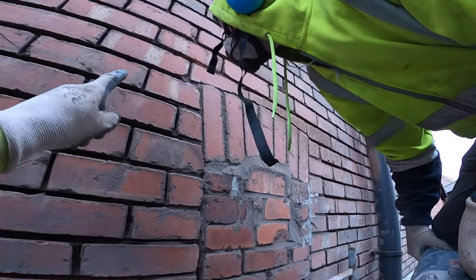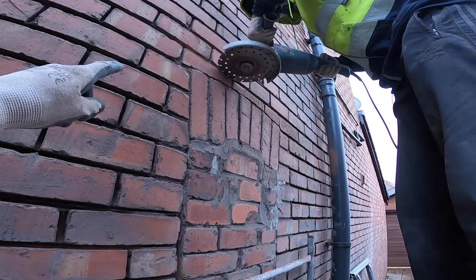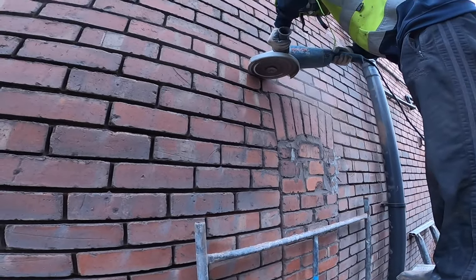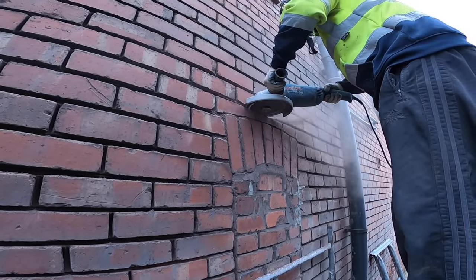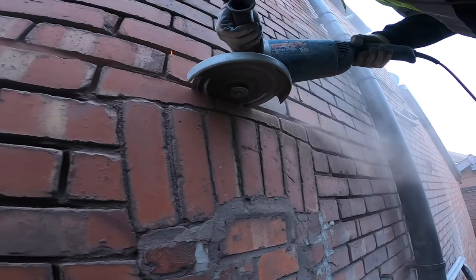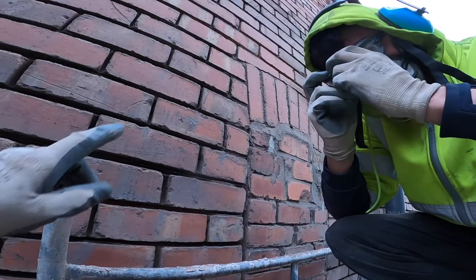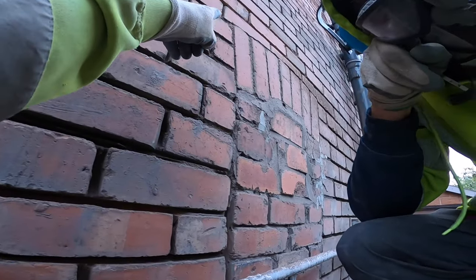Careful, you're going to cut into that brick. Right. Get your blade straight. Start again here. Start here. Start there. That's it. Now work back. See, that's it. Down your halves now. What I'm saying is, don't worry about overrunning into the arch brick. Otherwise, just your cut will be too shallow.